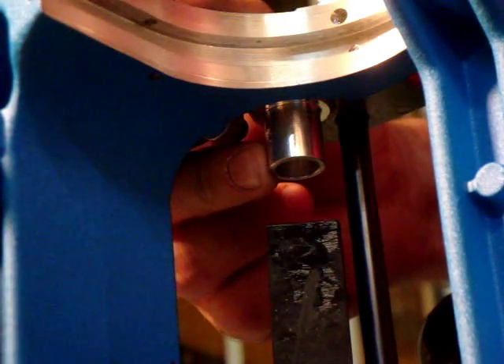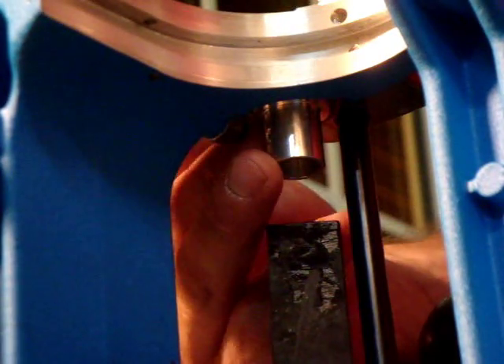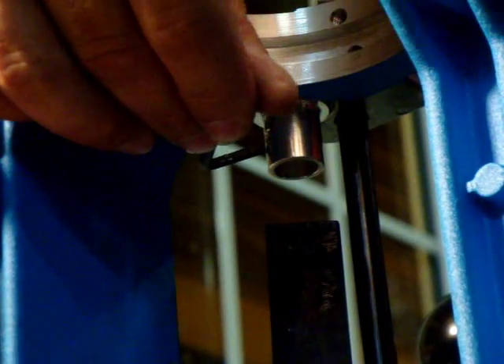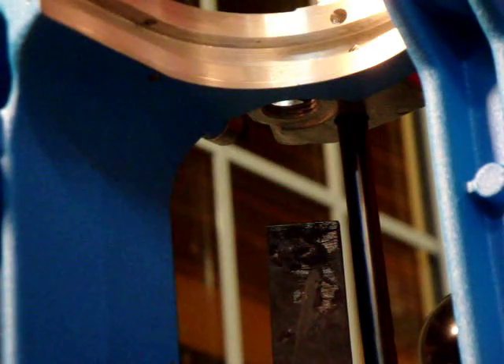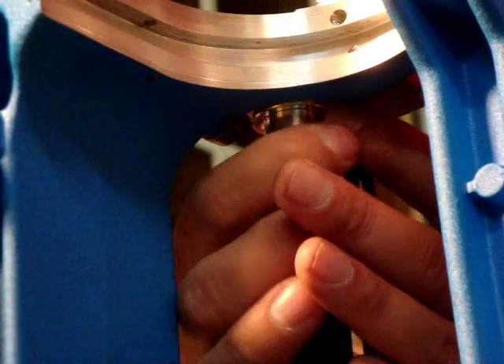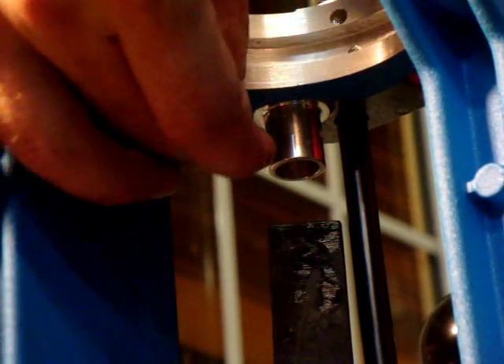The last piece in your caliber conversion kit for station one is the body bushing. These come in sizes like small, medium, and large. To change it, unthread it from underneath the feed arm drop system — it has two holes, and Dillon suggests using an Allen wrench in one of the holes to loosen and tighten the body bushing. Once loosened, unthread it, get the correct body bushing from your other kit, thread it in place, and use the Allen wrench to tighten it again.